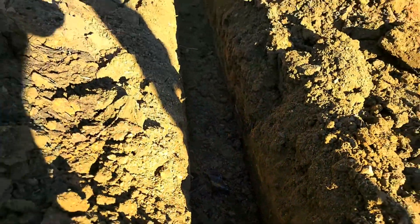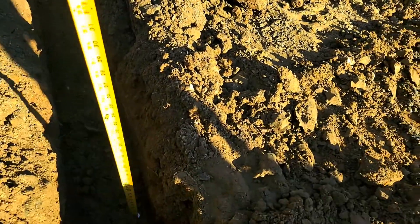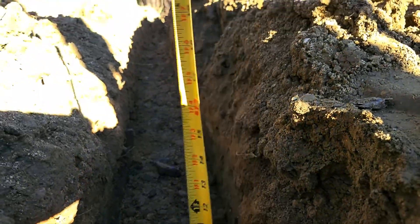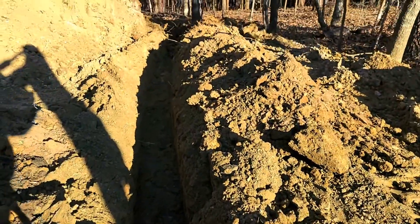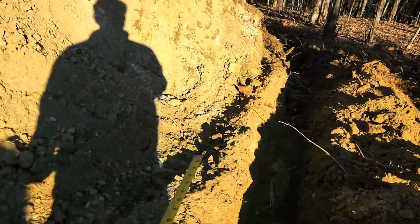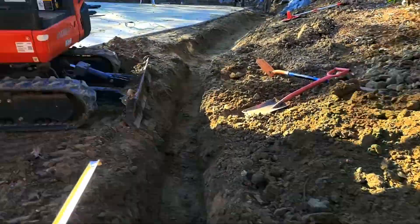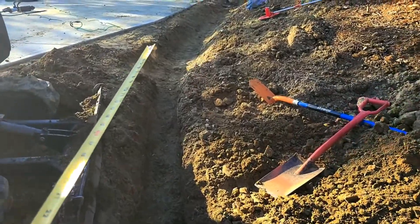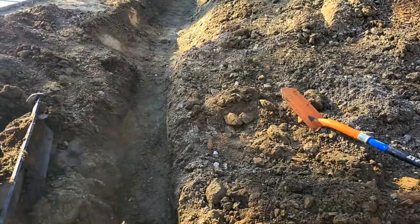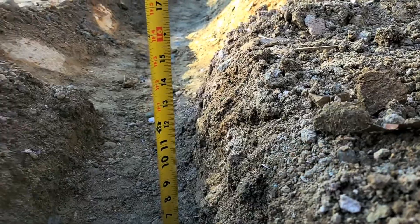You can see how flat the bottom is — it'll help the infill get around the pipe. It's a little raised up here on the edge but as you can see, we're about 15 to 16 inches below grade. We want to keep that depth and actually go a little deeper as we get down here. It shallows out to about 12 inches down right here at the edge where our trench starts — about a foot.